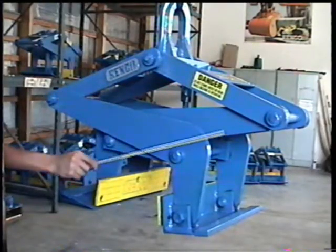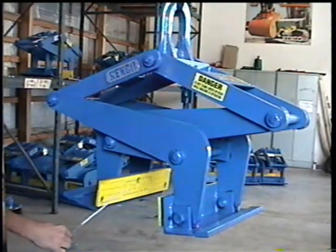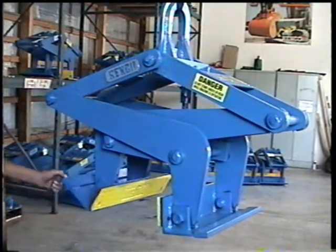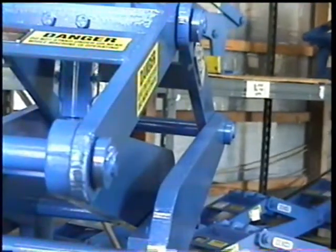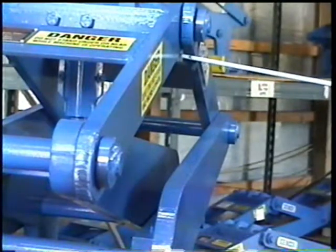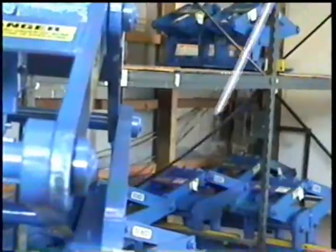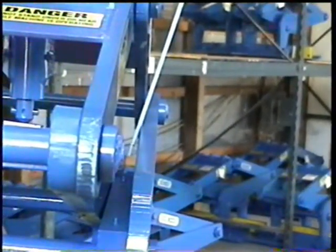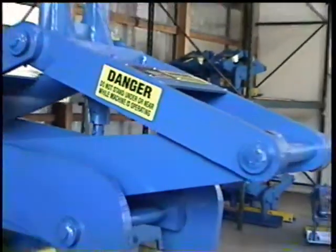Check the lifter visually for obvious signs of damage. Check the pad bolts to ensure snugness. Do not over-tighten the pad pivot bolts. The pad angles must be able to pivot. You should grease the lifter at these points on both sides. Do not grease the actuator. Use a light coat of penetrating oil.